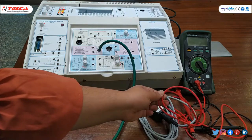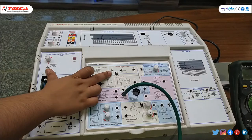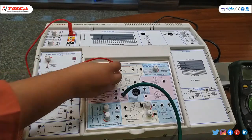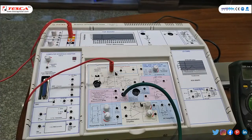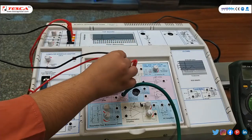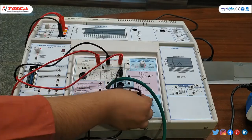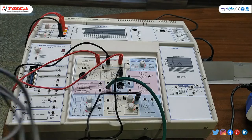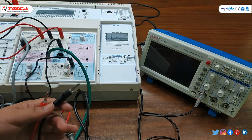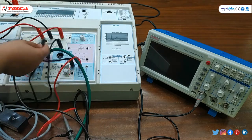We will make certain connections using these probes on the main unit. First we have to connect the power supply to the external power supply of module one. We will connect plus 12 volt to the first point, minus 12 volt to the third point, and ground to its second point. Then we will connect the fourth point with the fifth point and the pulse oximeter probe to the JK2D connector. Then we have to connect the CRO input to the sixth point and CRO ground to the second point.